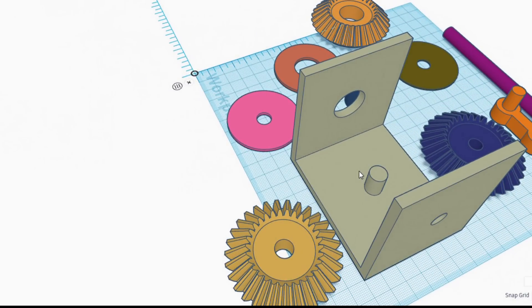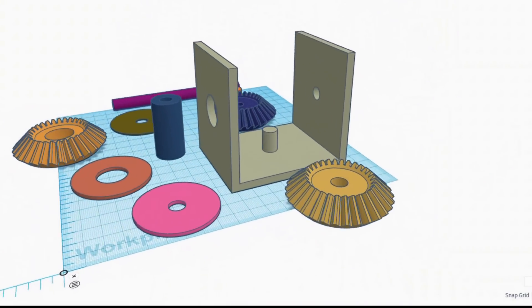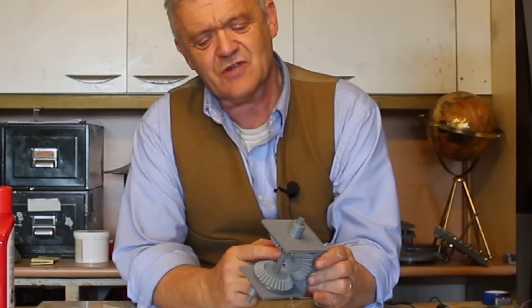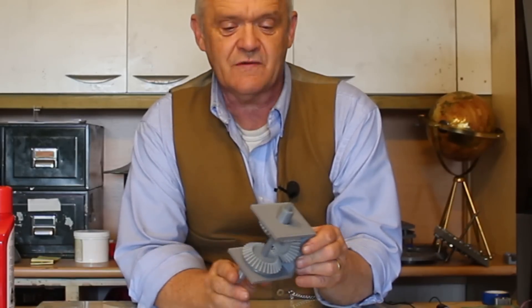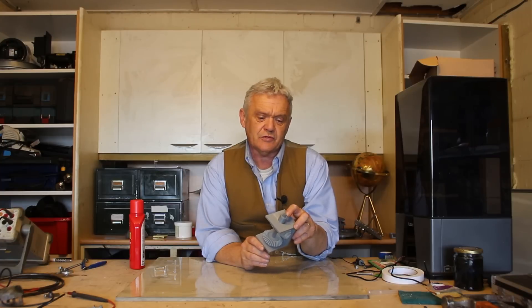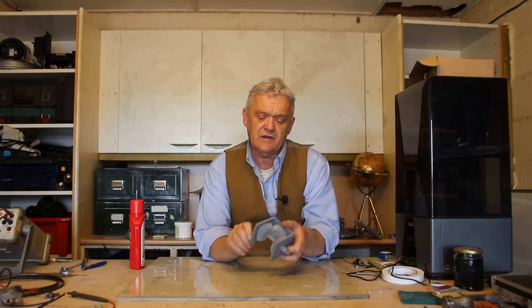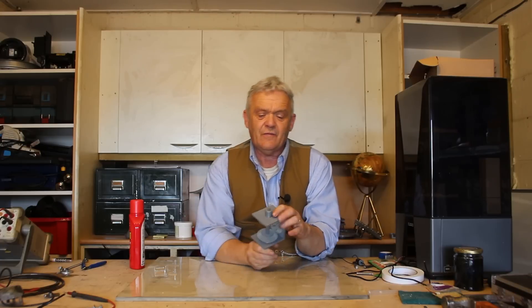Although that's a fascinating story, you've got to ask yourself why bother telling us that — and I want to tell you because of another friend of mine and T-cut. I've got this in Tinkercad; it's just a bevel gear, and when it's put together, rotating one gear idles the middle and rotates the outer one in the opposite direction. So we've got two outputs: a central pin that turns in line with the handle, and an external output that turns in the opposite direction.